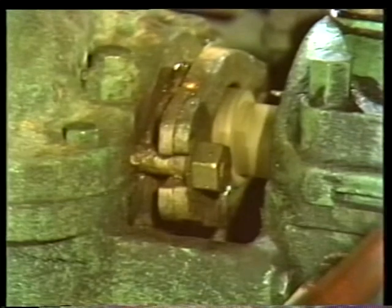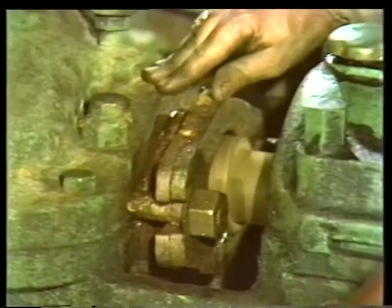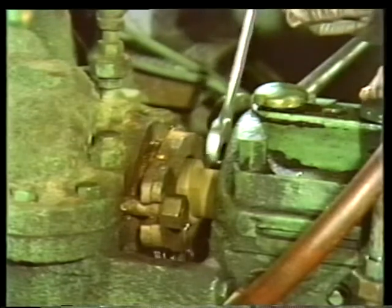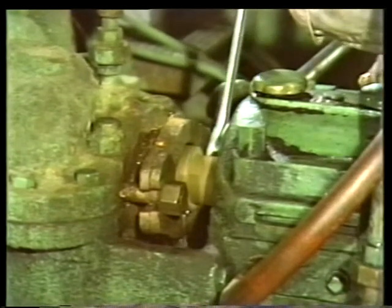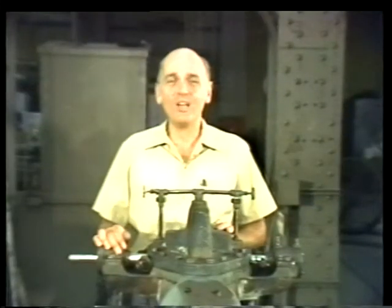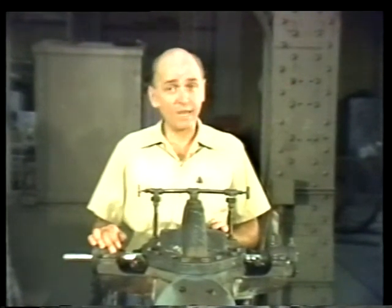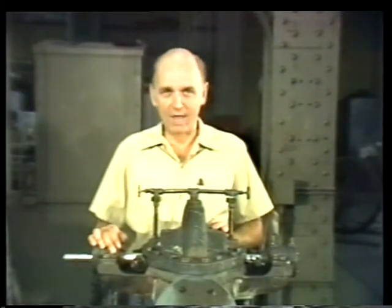With the pump running, check the temperature of the stuffing box. If it feels not just warm but hot, loosen the gland follower and increase the leak off until the stuffing box cools off. Adjusting the gland follower is the real art of packing a pump. You don't want the leak off to be excessive, but at the same time, you can't have the new packing heating up and damaging the shaft.